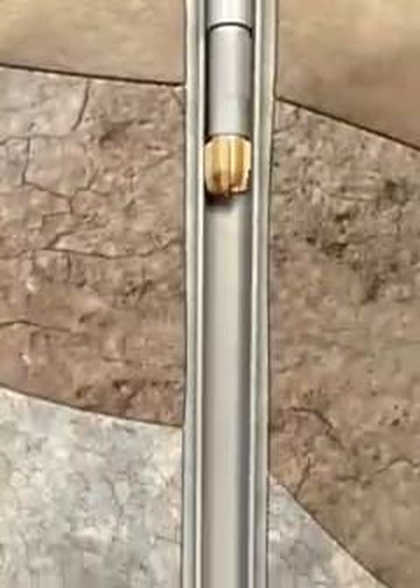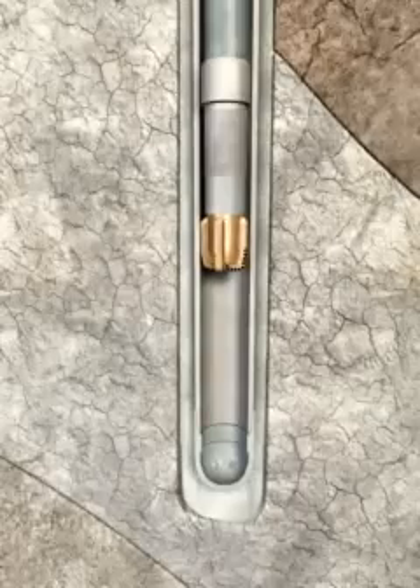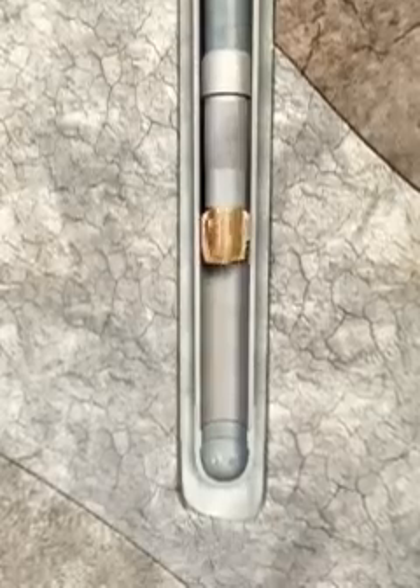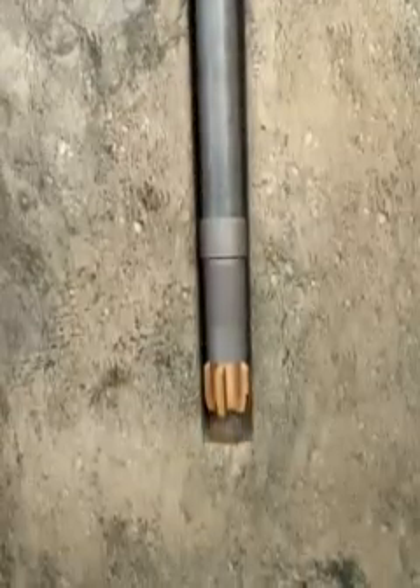In standard applications, the hole would be drilled to TD with drill pipe using conventional drilling techniques. Engaged in the top of the PBR, located above the Hanger Packer section, the running tool is used to carry the entire liner load in the hole, transmit torque between the drill pipe and liner, independently set the hanger and packer at a predetermined point downhole, and disengage from the liner when required.